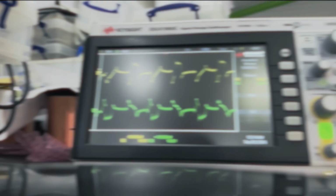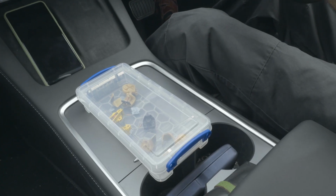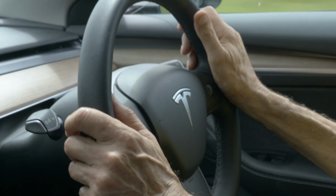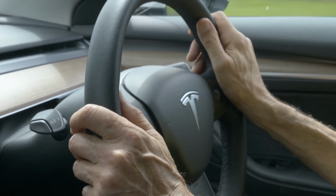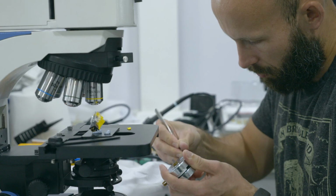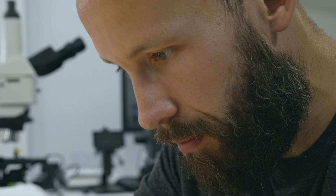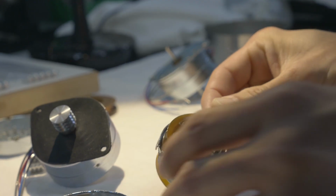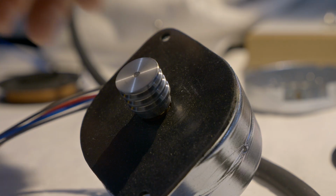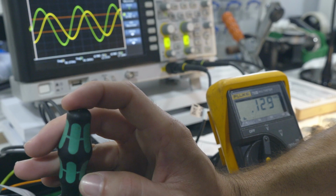Engineering as a science has developed around getting the maximum return in power, usually, at the minimum cost. If you have a motor that is in a wing mirror pod on a car, it needs to be very small, very powerful and very cheap. For a turntable, all of those parameters are entirely the opposite. You need minimal power levels, but the lowest possible vibration. But there are many, many aspects of a motor in itself that can reduce the vibration levels of a motor but are not important normally.